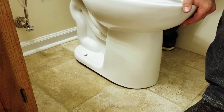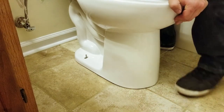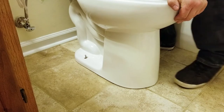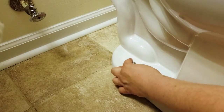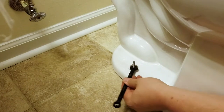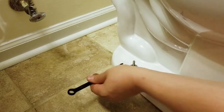When you install your new toilet, just align it with your bolts and put your weight on top of the toilet to squish the wax ring. When you tighten your bolts make sure you do not over-tighten — go slowly on each side of your toilet.